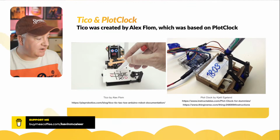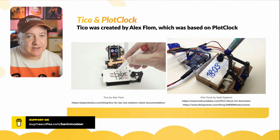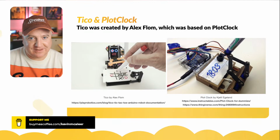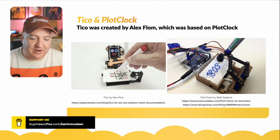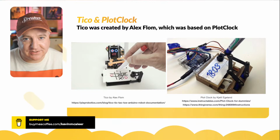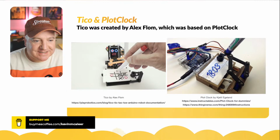One of the challenges I came up against is you can't put text on anything other than a black background. It must be a really simple library. Instead of just taking whatever background colour it is and XORing the text over the top, it just blasts black over the screen. So if you try and have a nice graphical display and then you put text on it, it looks really ugly. So I might have to improve that code. It'll probably be a bit slower perhaps because it has to do a bit more, but that's not a problem. So let's have a look at this thing in action, shall we?